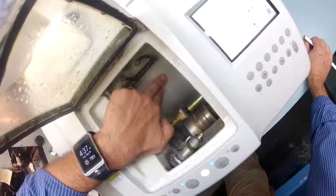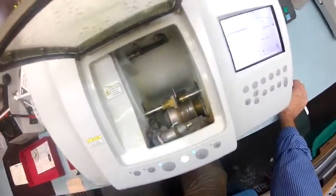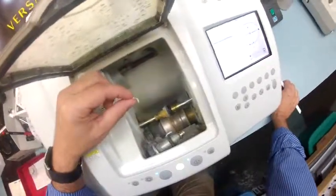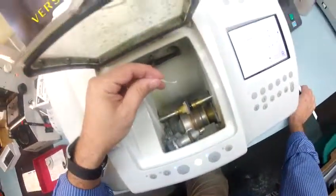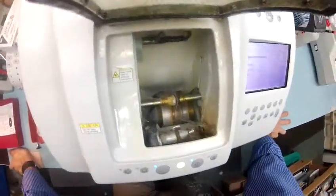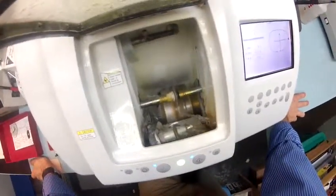There's water running in the background, but the lens is cutting dry — this is just to collect dust. Plastic and high index cut wet; polycarbonate cuts dry. In just a moment, some water jets will kick in to start washing away what I've just removed from the lens — it's called swarf, like optical sawdust — just cleaning any residue that may be on the lens. As soon as it comes out I'm going to put more on there, but that's a moot point. The machine is just trying to do its part.